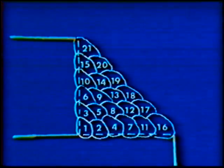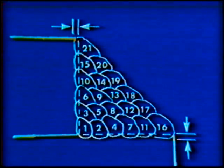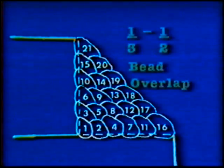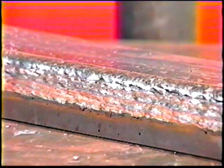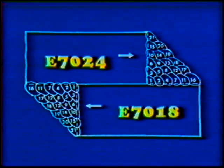The remaining four layers each require one additional pass as the joint widens. Be sure to melt one sixteenth inch of the outside edges of the joint for both of the outside beads in the last layer. Each bead in a layer should overlap one-third to one-half of the previous bead, and each layer should fill the joint to a depth of one electrode diameter. The finished weld should completely fill the joint, forming a flat to slightly convex face. Notice that it takes the same number of passes to produce the one-inch fillet with the one-eighth inch E7024 as it does with the five thirty-seconds inch E7018. This is due to the higher deposition produced by the greater amount of iron powder in the electrode coating of the E7024 electrode. Inspect the weld and continue practice.